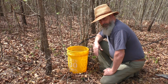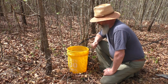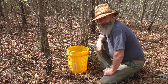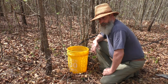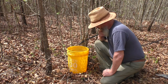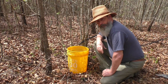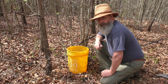So first part of the experiment, will a 1/2 inch to 1/2 inch pump water? Yes, it will. How far will it pump it? About 200 feet, but not real fast. And it will pump with a garden hose as your output, without having real hardened pipe. Not only that, this garden hose is 3/4 inch, so I went up from 1/2 inch to 3/4 inch. So I learned a few things on this trip. And so next video, I'm going to try a 3/4 inch to 1/2 inch and see what the capabilities are on that. But for now, it's a sort of win.